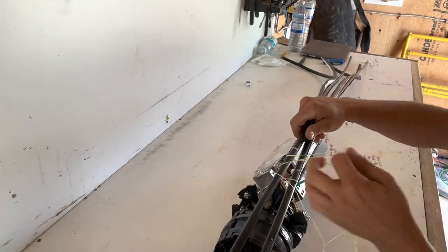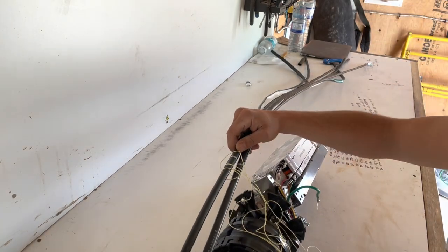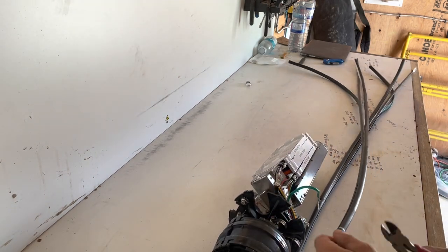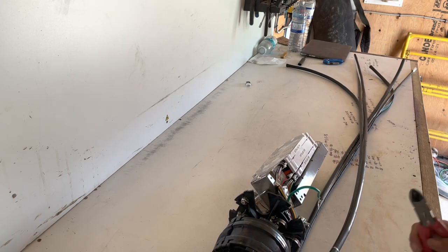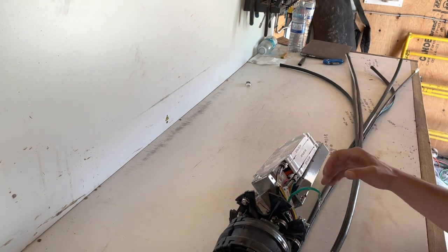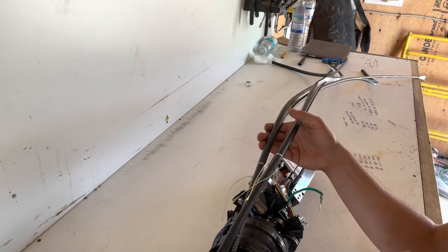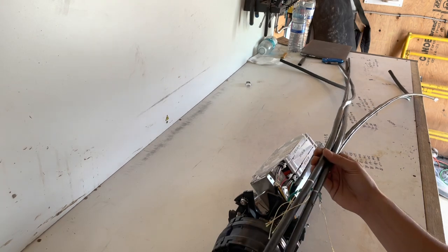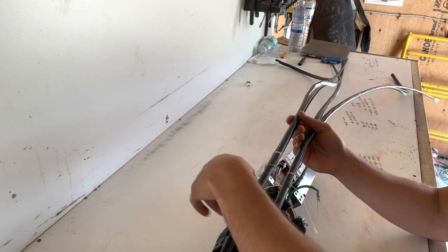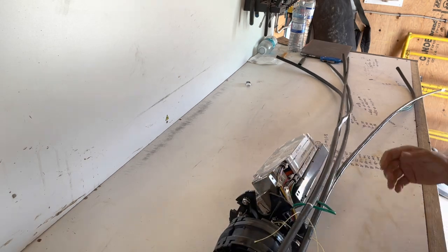Now we have our rip cords pulled down to our ring cuts. There we go, we got them pulled down there. One thing that's nice to do is leave a little bit of rip cord just in case something happens, fiber breaks, anything that happens to these cables, and you need to get back in there and strip more cable. Well, now you're not having to worry about doing a ring cut. Obviously it's highly unlikely we're going to be breaking any fibers, but a little something just in case. I have had to do it before, and luckily I left some rip cord, made it a lot faster.